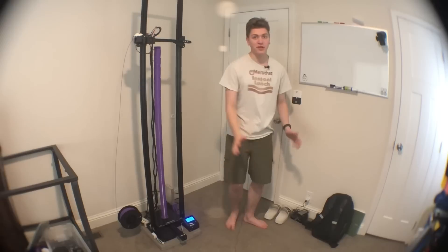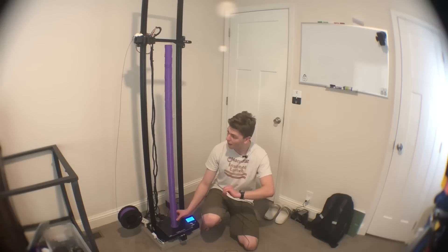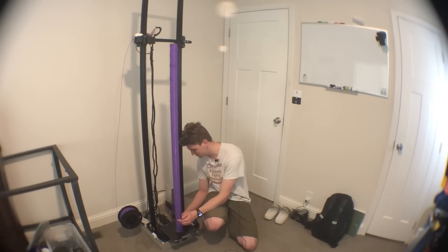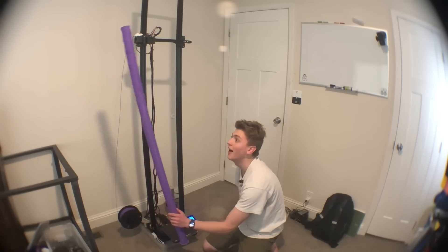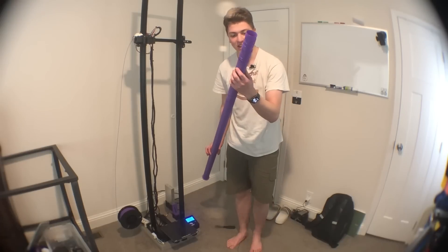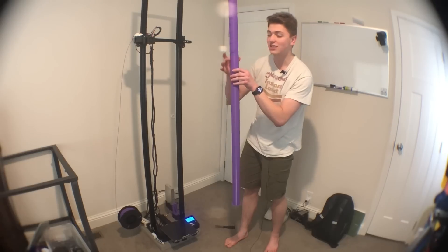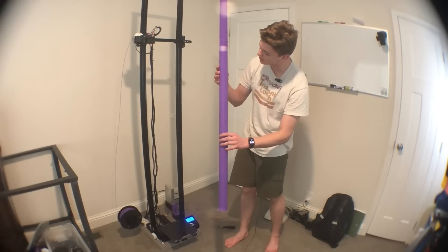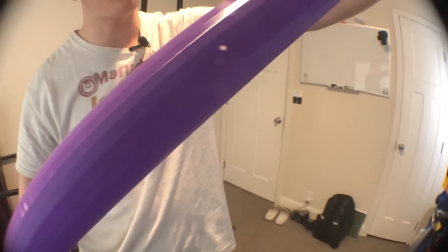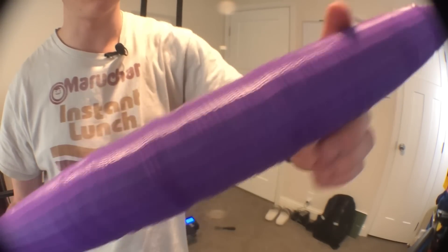The first tall print on this printer is done. I'm about to pull this thing off of the bed. Oh my god. It looks a little scuffed, but considering how long it goes until it starts to have deformation and print defects, that's really good. I printed this tube to see when it would start to wobble, and I could not believe this was my first try — only having to replace the rails, the screw, and do some adjustments in the slicer settings to get it to print.